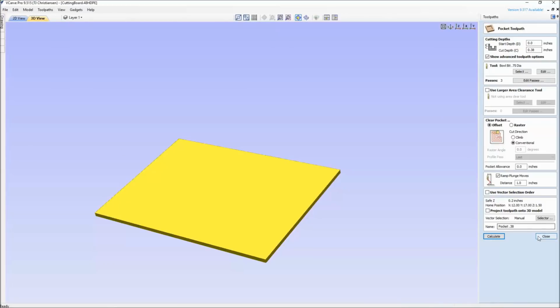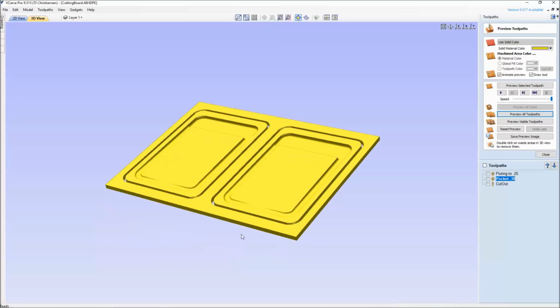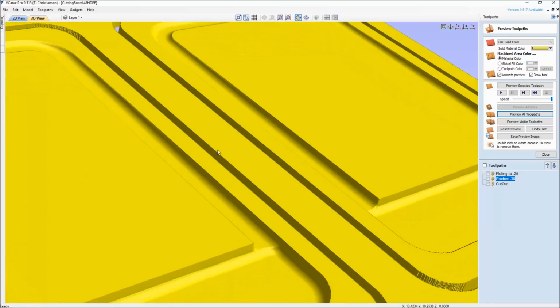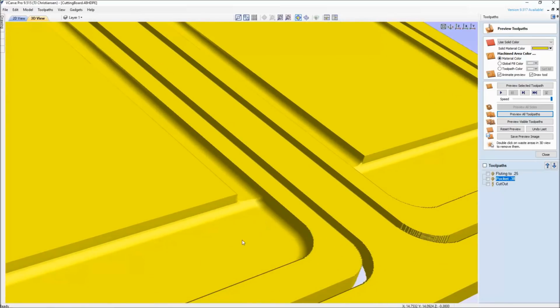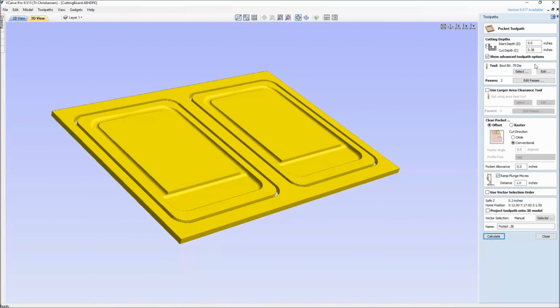And you can see that here in the 3D preview, and I'll show you exactly what it is that I'm saying. This just leaves a little bit of a lip right here, so that whatever juice flows down here doesn't flow back up right away unless you had a lot of it flow down in there. So that's why this pocket has a little bit more depth to it.